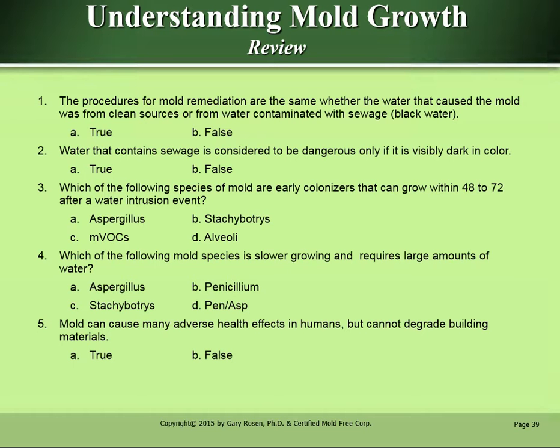Understanding mold growth review. Here's some test questions. The procedures for mold remediation are the same whether the water that caused the mold was from clean sources or from water contaminated with sewage, black water. I'm going to say B, false. Water that contains sewage is considered to be dangerous only if it is visibly dark in color. I'm going to say B, false.